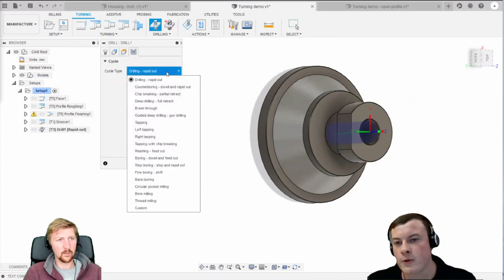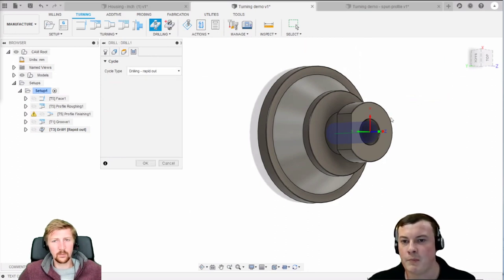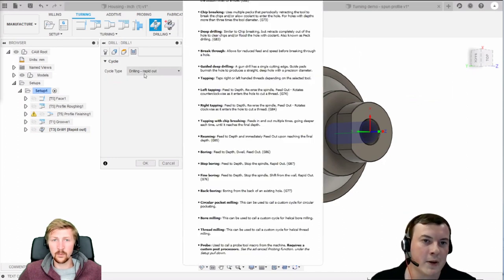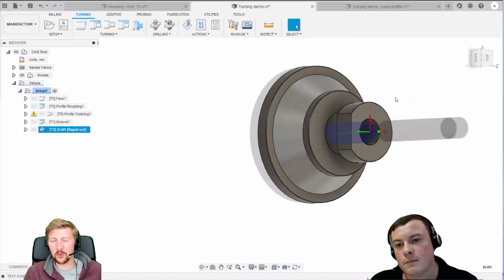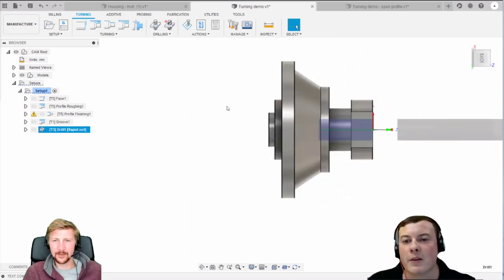Once we've got our drill, it's literally just a case of selecting the hole face. With U-drilling it's important to get the cycle right - you don't want chip breaking. You just want to drill to depth and then retract all the way out. With U-drills there's so much cutting force being exerted that it can actually cause the part to slightly wobble - running eccentrically from the spindle - and chip breaking can cause the part to kick in the spindle. So always keep it on drilling and retract straight out. Through coolant is also helpful for swarf evacuation.